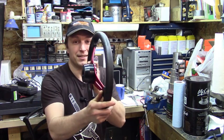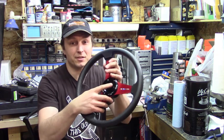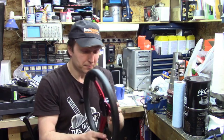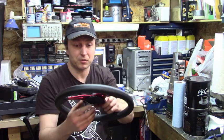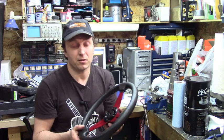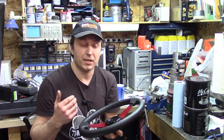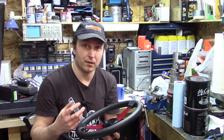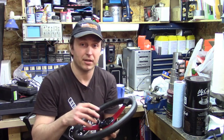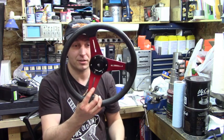This is a quill wheel for a round column mill drill. It looks a little different in the center because the button with the bezel is missing — it can't be there simply because of how it mounts. It's a Delrin hub just like the ones for the full-size mills. We'd been discussing material types and design ideas, because the hub on the actual round column clones is a fairly complex little piece of cast iron with an internal blind keyway and all sorts of fun stuff. But this is what the two of us head scratching came up with.